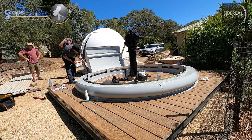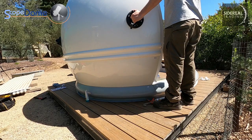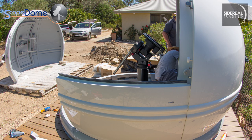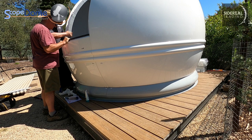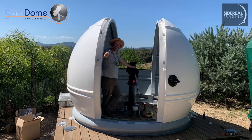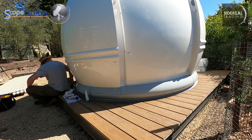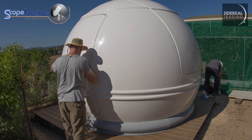Before we install the second panel - that's the left panel, which faces east - we put in yet more silicone. Then we bring in the left panel. This is heavy and we use suction grabbers that glaziers use. Third, the right panel, which faces west and which has the door, is even heavier. This is the heaviest part of the job. The fourth, or rear panel, which faces north, is pretty simple - just more bolts and silicone. The shutter panel, which is the part that moves up and down, has to be lifted into place and threaded between the fittings. The limit switches go in at this point as well.